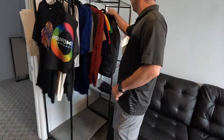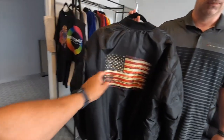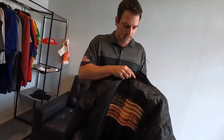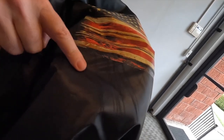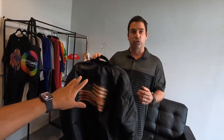Here's another one where our product is really different. This is a nylon jacket. I know you guys are talking about nylon — can you print on nylon? Look what's going on right here. This is nylon, and this is our proprietary super low melt adhesive. Even if you've got another DTF, you can use this adhesive — though check with us, as some ovens are not compatible because it is a special adhesive. It will go on anything, including nylon. We've got people putting it on wood. We've done a scratch test, took a pair of scissors to it, and even though we've damaged the nylon, the print's still good.